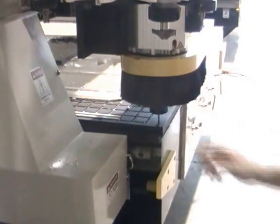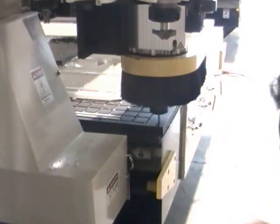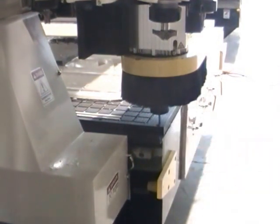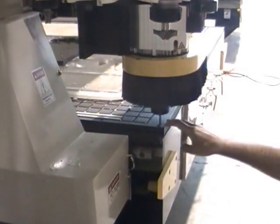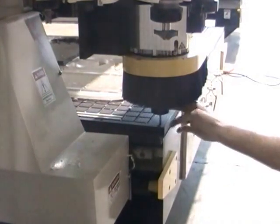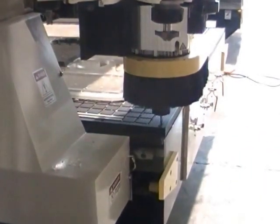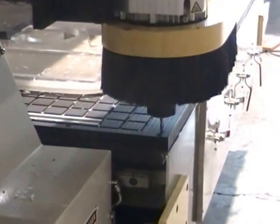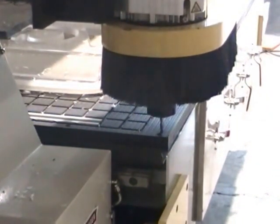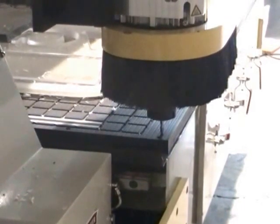You generally want to spin the tool. You just want the tool to be touching the tabletop slightly, so we turn it. You can see that they've made contact but you're still able to turn the tool — that's the point where I'm going to measure all my tools. Tool number one, two, three, four, five — I'm going to bring each to that point and set that as my height reference.